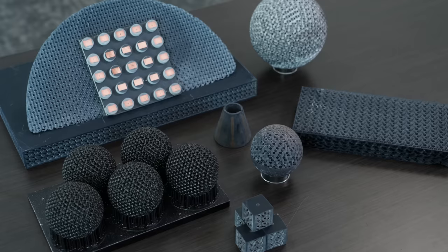Right — we have the technology, so we can start building. We need some sort of structure that has smooth gentle curves, no isolated elements, and that can be generated easily with a variable density — something like a sponge perhaps. There are various structures that'll work, but one of the best is based on another simple formula. Not only does it create a stiff structure with no lines of weakness, but it's guaranteed to be completely free of closed internal voids and has no isolated bits or peaks that would be disconnected from the rest of the print. Even better, it's based on a unit cell that's a cube, and the formula can generate a structure many unit cells wide, deep and high. You can vary the thickness of the wall of the unit cells smoothly so the effective density of the material varies in any direction you choose. You can also define the boundary of the structure with another formula to make a cube, plate, disc, cone, sphere, hemisphere, or just about any other shape.